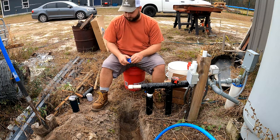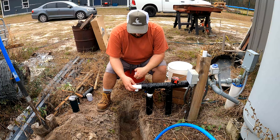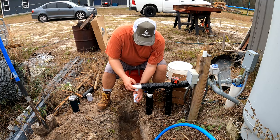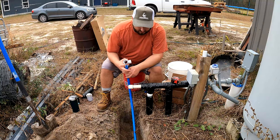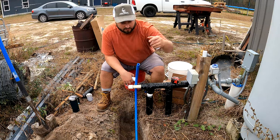Let's do some plumbing. So I've got a one inch T that reduces down to three quarter. I'm going to put a three quarter inch valve — I'll probably put it back on this side so it matches my one inch over here. And then we're going to run into that, run our pipe down into the ground and then tap into this three quarter inch pex that we ran out to the pig barn.